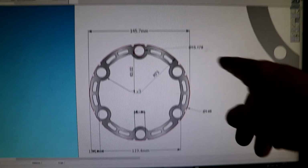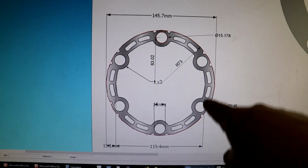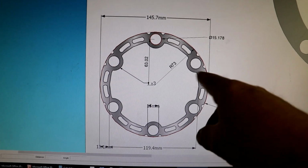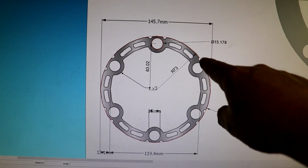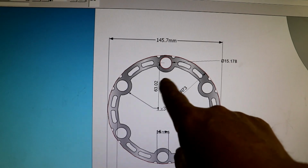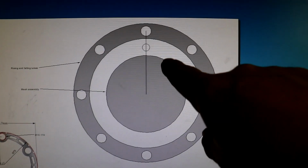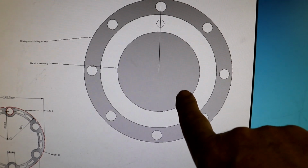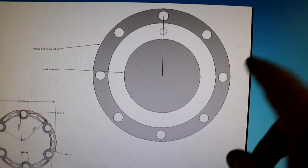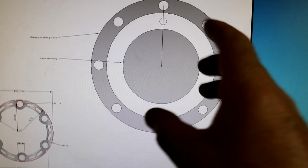I thought it'd be clever and drop an image that Dan had sent me of the ring that holds the 6 copper tubes in place, in position around it. Drop it onto the CAD software and then shrink and expand it so it actually is the size that it says it is. And I thought, hold on a minute, the mesh thing in the middle is bigger than that. So I drew the mesh thing, that's the actual size of the mesh thing. I then drew another support for the 8 rods that go up and down, and that's the amount of room I've got left in the middle. I'm so pleased I checked.